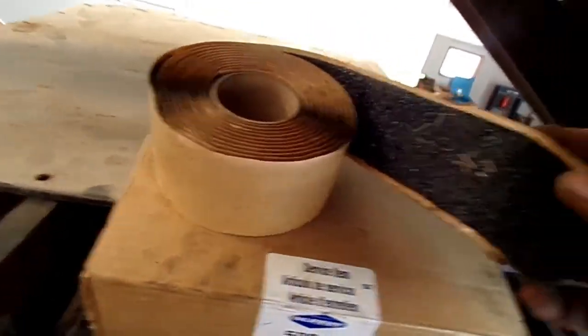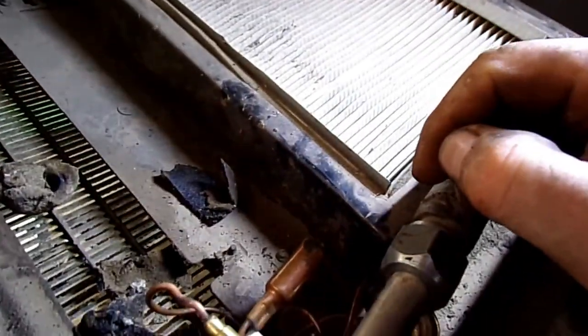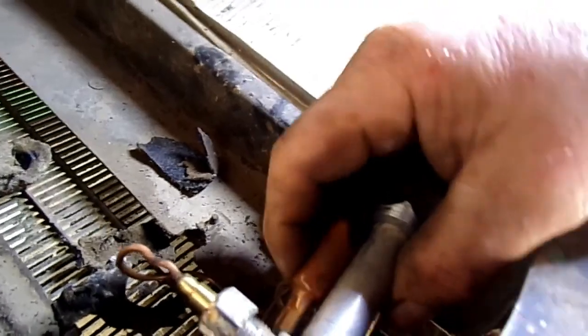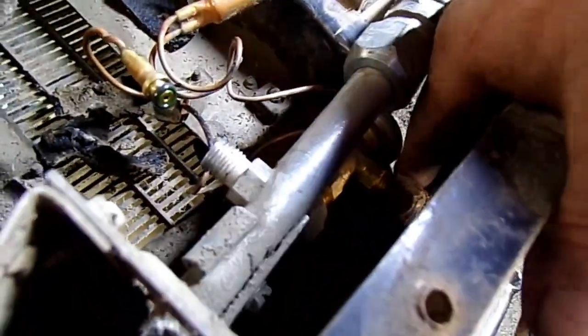I'm up here on the cab — this is a better look at the expansion valve. This was the old AC tape that I cut off. I might as well go ahead and get a box of this AC tape so we can go back with new tape around it and get it all insulated. I think somebody's been in this before. This temperature bulb is just like that, and I believe it needs to be contacting this suction line — this is the bigger line up here. This has got three connections: this little connection for the temperature bulb, one on the lower, and one where it goes into the evaporator.